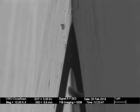All right. Now, you can see what's happened. It's very subtle, it's just rounded towards the end. Now, I believe that this was done on a pasted strop, but regular stropping will do the same thing on your linen or whatever. It just does it at a slower rate, but it still micro-convexes the edge. Now, what I'll do is show them side by side. If you want to look at that, you can see the difference as far as that very subtle micro-convexity is.